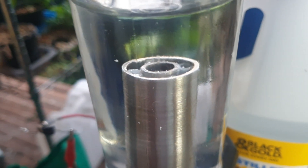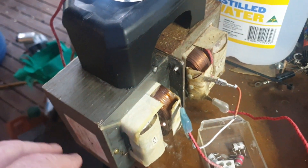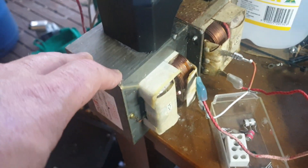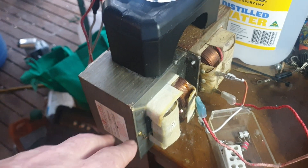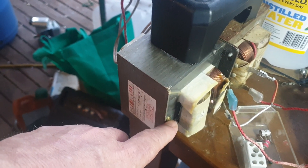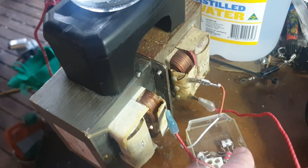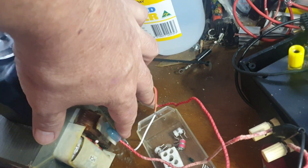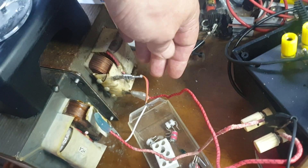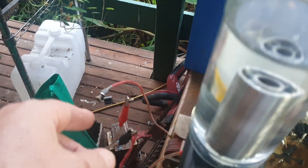Today's experiment has high voltage only to the cell, using two microwave oven transformers bolted together, joining the secondaries by the fact that they're bolted together and the secondaries joined to the iron. It's probably not the best way to do it. When I tried to get high voltage by bringing the Lawton circuit into the primary side going top and bottom and joining the bottoms, I got no high voltage. Going bottom side to top side and joining on the diagonal gave high voltage.